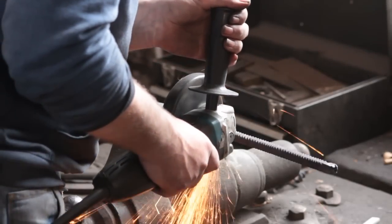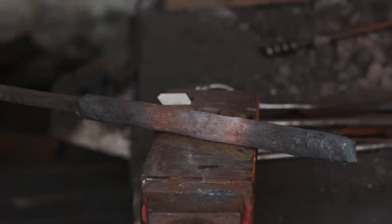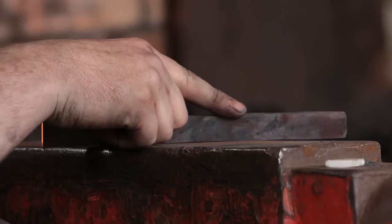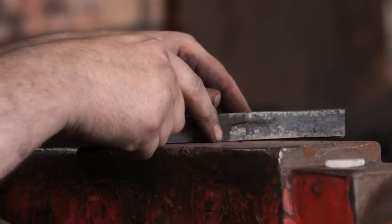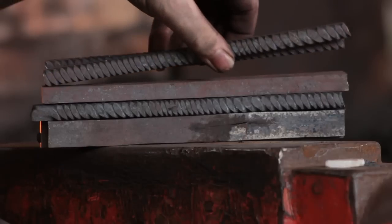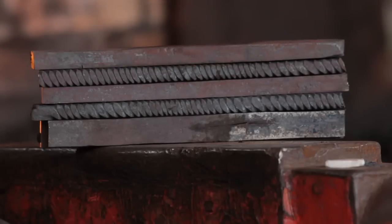I'll now cut it into nine-inch sections. For the next bit I have a piece of 18th-century wrought iron left over from previous jobs — I'll forge that out to 24x12 and also forge some out to 6x25. We start off with the carbon steel core for the edge, and either side of that I'll lay some 25x6 wrought iron. On top of that we have two twisted bars, on top of that a piece of 25x12 wrought iron, two more twisted bars, and the final piece of 24x12.